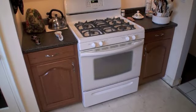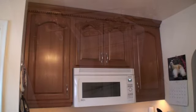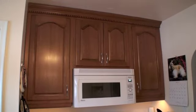All of the cabinets are constructed of 3/4 inch maple veneer plywood using dados, rabbets, and screws with glue. The face frames, doors, and drawer fronts are constructed of 3/4 inch kiln-dried cherry. The cabinet interiors are finished with 3 coats of water-based polyurethane, and all outer surfaces are sealed, stained twice, and finished in 3 coats of oil-based polyurethane applied with a brush.